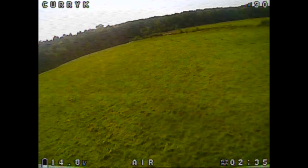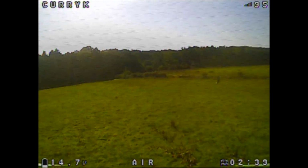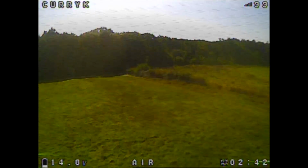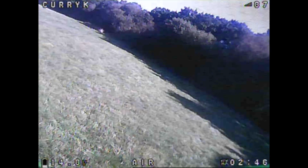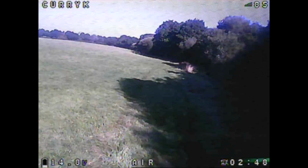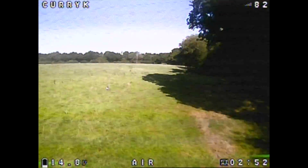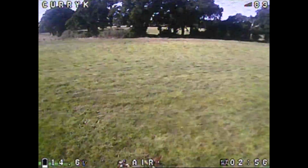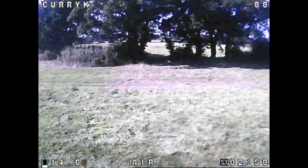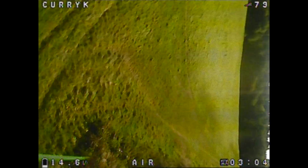So sometimes this is looking actually fairly smooth, and other times there's a little wobble. But I'm thinking, okay, if I was on something like a 2.1mm lens here, would I actually see that, or would I just think, yeah, that's just a tiny bit of prop wash or something? And I question these props. They're again unfamiliar with me, so I decided I couldn't really do much more on the tune, because it's like, well, that's just a case of this is how this thing is.